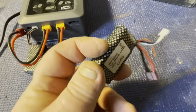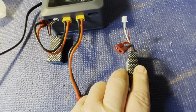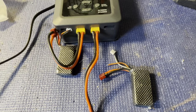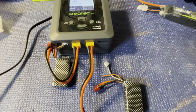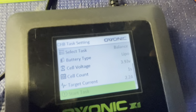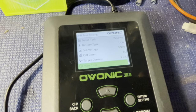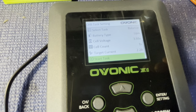One thing I wanted to try is this 850mAh battery — the twin to the one currently charging. The wire pulled out of the balance port, so my LiPo tester only shows 1S. I'm going to plug this in and see if the smart charger reads it as 1S or 2S. As you can see, it's not reading that second cell. If I take that wire and plug it in, now it tries to read 2S. This shows the charger is smart. I have a new balance plug to solder on — just wanted to demonstrate that feature.